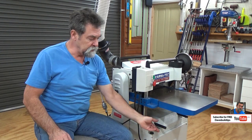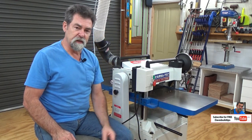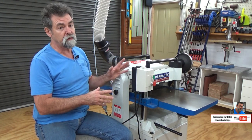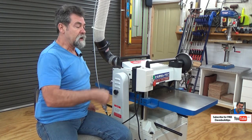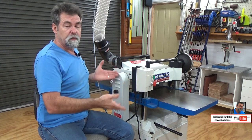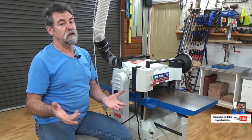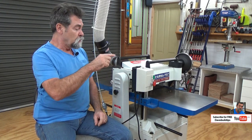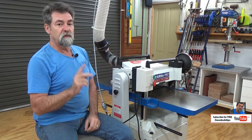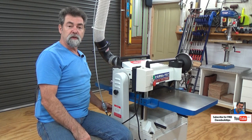For lifting and lowering this machine, there are lifting bars down here. Don't try to lift the machine by the infeed or outfeed table — they're not designed to take that kind of load. This is a heavy machine, around one third of a tonne. There are four bars, front and back on both sides. If you've got a forklift you can pick the machine up and put it on a truck or trailer, or you can sling it with an engine crane. They slide back in when not being used.